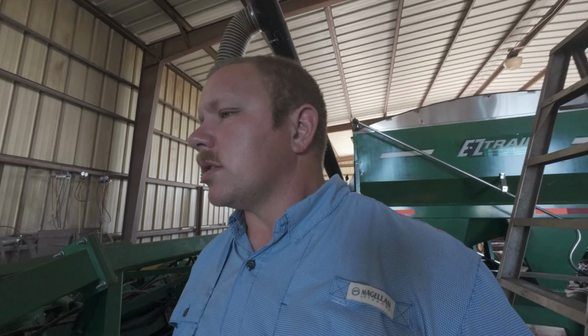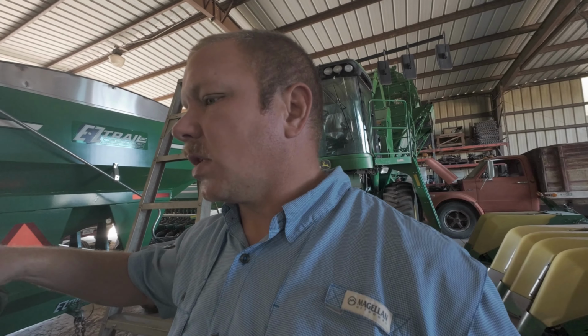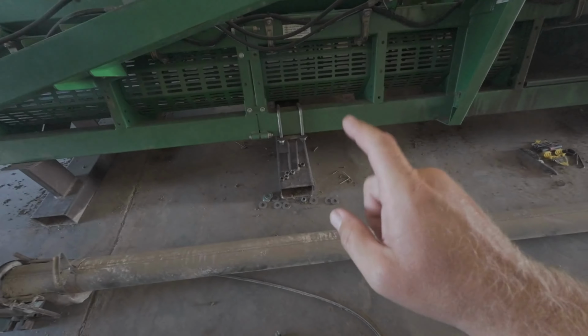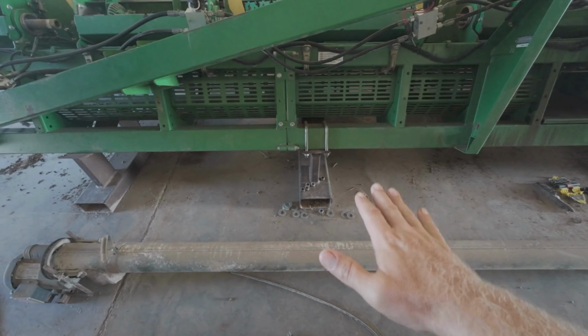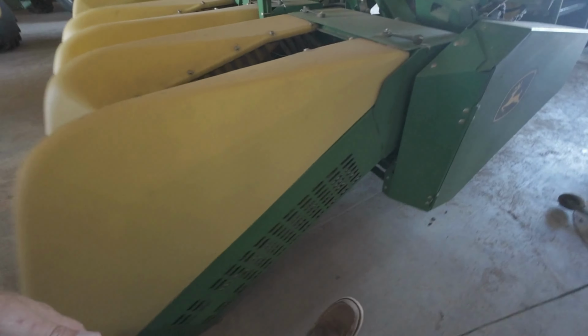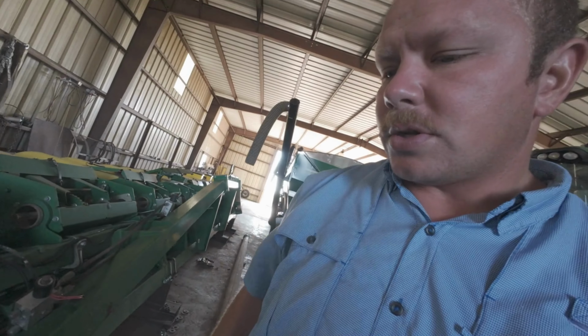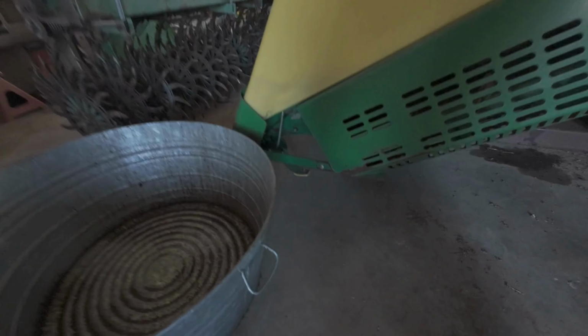What I'm going to do this morning is try to get the stripper hooked back up to the header, because I need to get these stands off to be able to let the header all the way down so that the row units are resting on the ground, like this one is here. The weight is off that cylinder so that I could get that same deal. I get that pin out and be able to slide the unit better. And so right now the row units are floating like that. So I'm going to pick it up, be able to get under there better, get those pins.